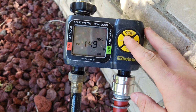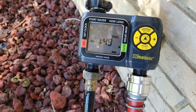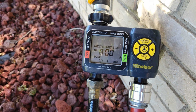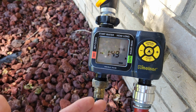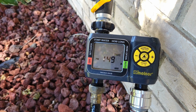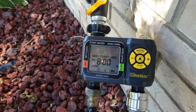Now, once we get everything programmed, we're going to go back to the time. If it doesn't say off on your screen, that's how you know this thing's programmed. It'll program through zone 1, next start time at 8 a.m. tomorrow, since we picked 1 day, and zone 2 at 8:43. So if I left everything as is, this thing will run every day for zone 1 at 8 a.m. for 40 minutes, shut itself off, and then run zone 2 as we programmed it.